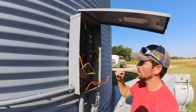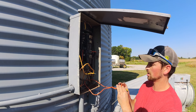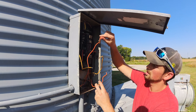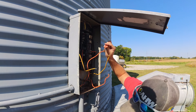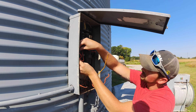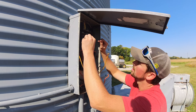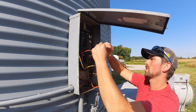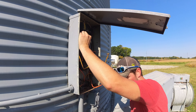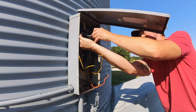So I'm undoing one wire, one circuit, to hook on to another circuit. Right now I unhooked the unload auger, which I don't care about now, in order to hook on the fan plug — because we'll run the fan now and then we'll swap this breaker over to run the unload later in the year.